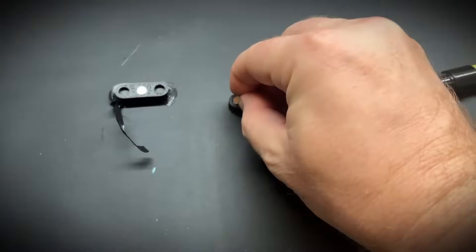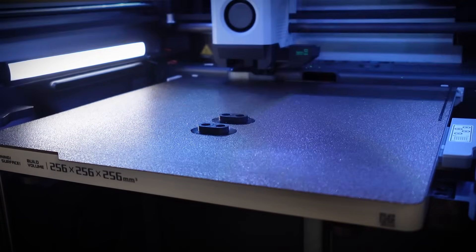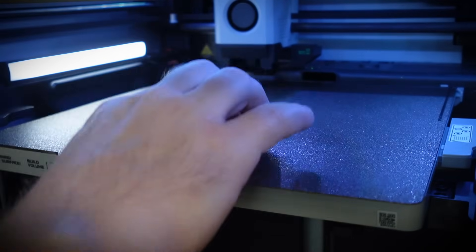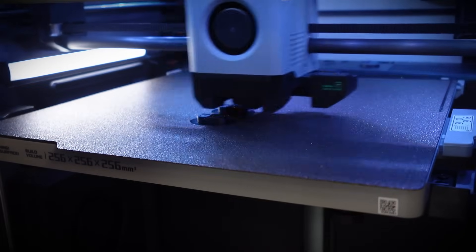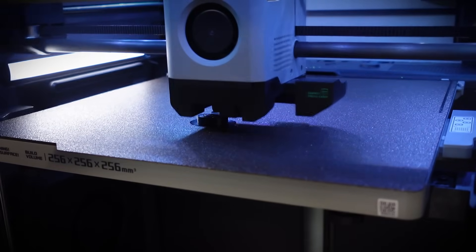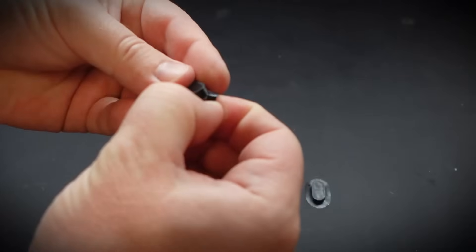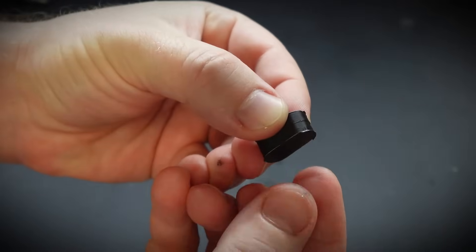So I think we're going to have to redo and just stick to the 6.2mm magnet size. Here I've made a new model using just 6.2mm holes — I'm pressing the magnets in and it takes a little bit of force but you can still manage to get them in. Hitting resume on the print will cause it to start printing again once the nozzle is heated up, and it will start printing over that final layer. Because it's press-fitted into the 6.2mm hole, the magnet isn't jumping out this time and it's printing directly over the top. Once we remove the brims we can give it a test — and it attracts to each other quite strongly. We can move on to something a little more complicated.